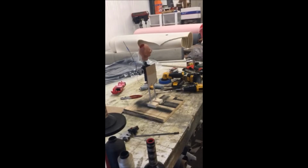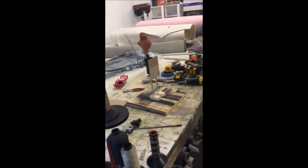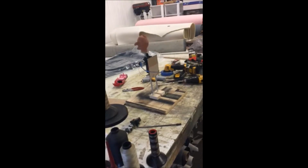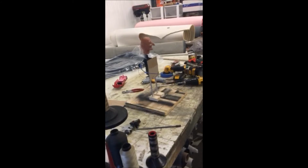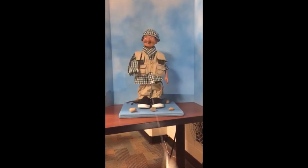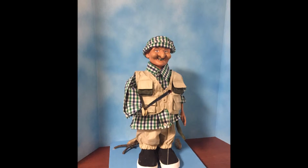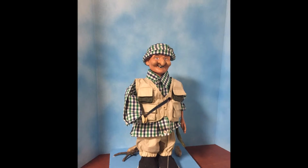With our group's test and check portion of the design cycle, we really had to ensure Uncle Roy's motors would function properly. We found that his initial fishing rod was too heavy for his arm motor, so we replaced the fishing rod with a lightweight straw. Also, after we clothed the animatronic, we found that the clothing was too heavy for the arm to operate also. We reduced the weight of the shirt by trimming the excess material. Before FED, we continued to test Uncle Roy on several occasions to make sure he would operate correctly for the judges.